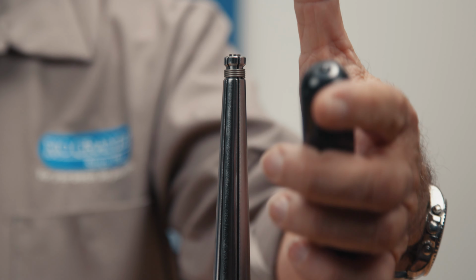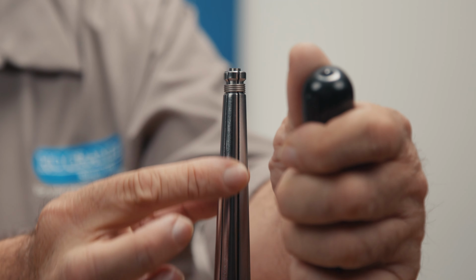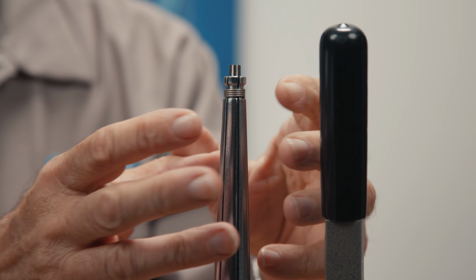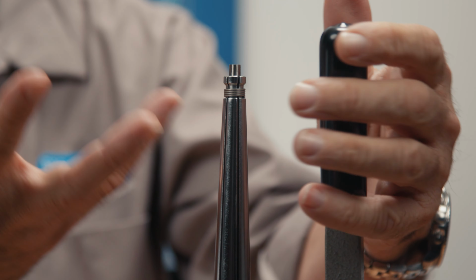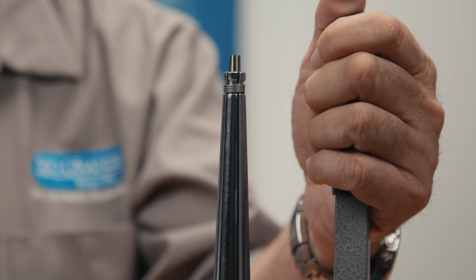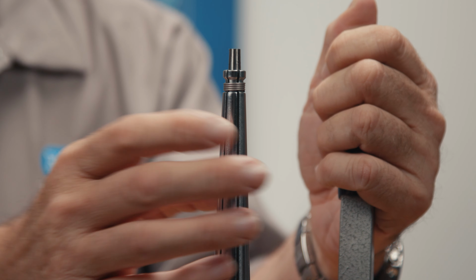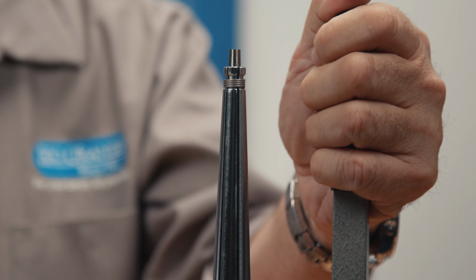As I pull the handle up and down, it's going to move this plunger between these splines, and these create outward pressure on the inside of the ring, stretching the ring from the inside. So every time I move it up, they expand and it stretches from the inside.